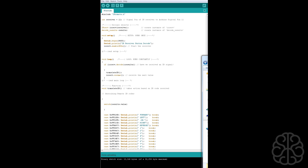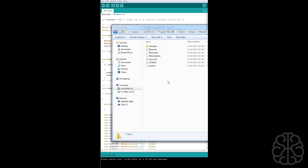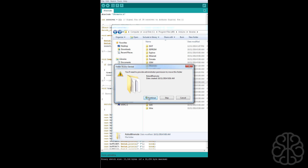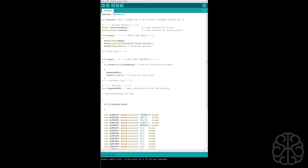You can download the library from the description on our website, or if you're on YouTube there's a link in the description. Extract the library to your library folder — call it IR remote. Also, drag out the Robot IR remote that comes with the IDE software because it seems to interfere with our library. Just drag it out of the folder, and once you're done you can always drag it back. Then restart your IDE software.